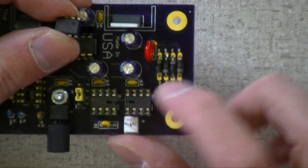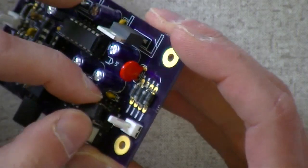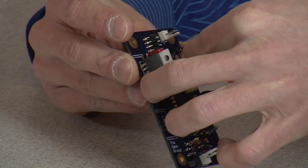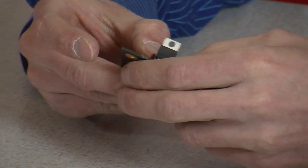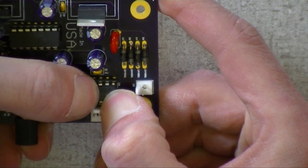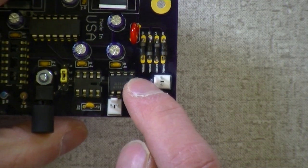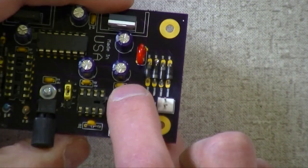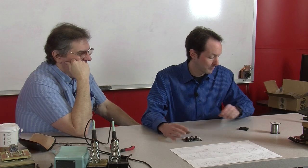These are just little metal bars that pass it through. So here's our little secret. This is the important thing to keep in mind: you can screw this up a little bit, and there are screw-ups that actually matter, and there are screw-ups that don't. If pin one on the chip is at this end, and pin one on the silk screen is at that end, and the socket's backwards in the middle, it's not going to magically twist the connections around. It's going to work fine.